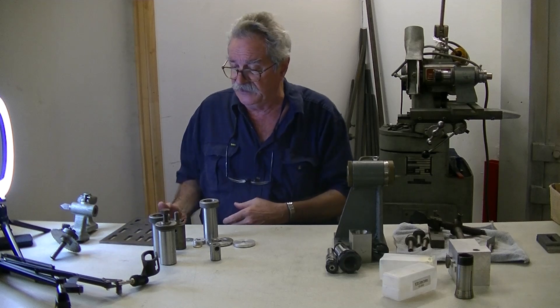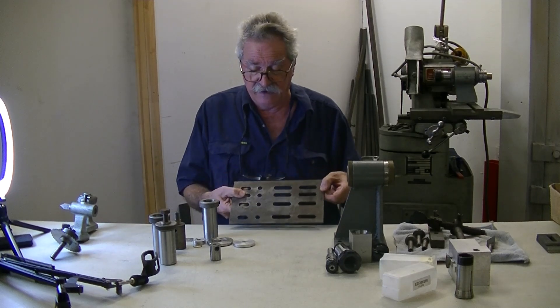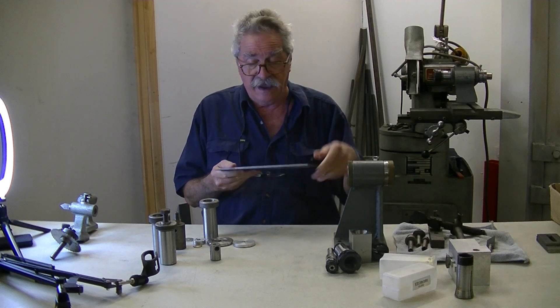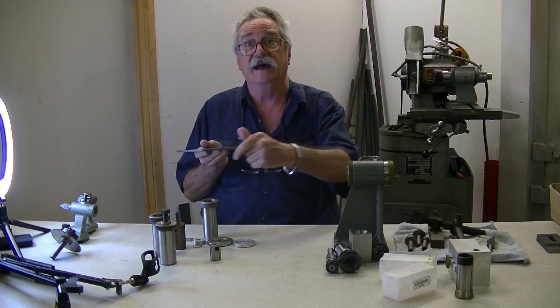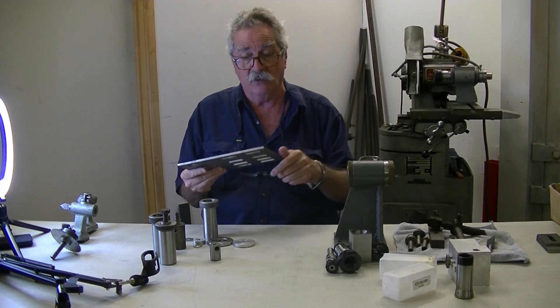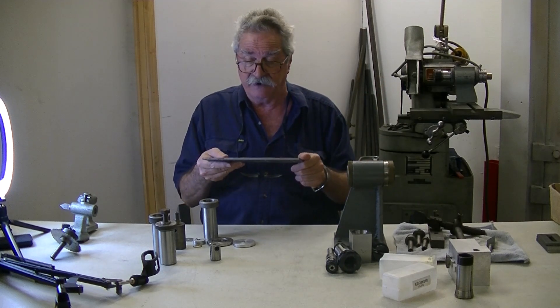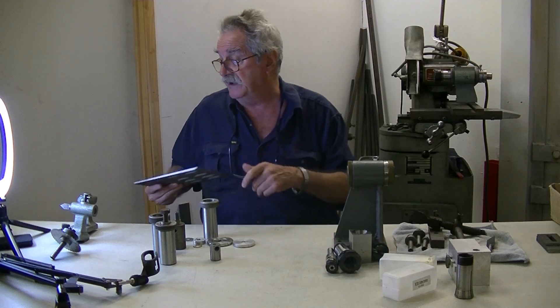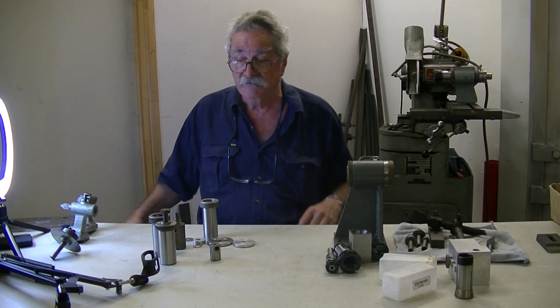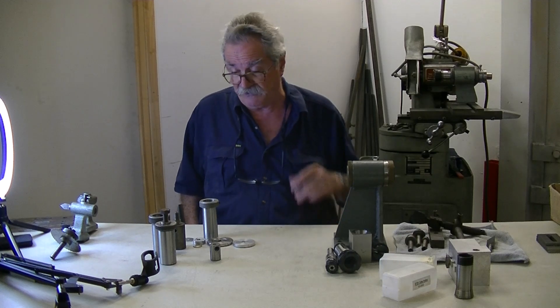I think we've all seen this before, but it's worth a mention. We've got the subplate that holds the top of the tool and cutter grinder. It gives me about 230mm extension in most directions for holding the index or work in. I use this frequently and I've even used it on the milling machine. Pretty good idea, easy to make. It was made mostly on the shaper, except for the holes of course.